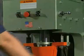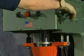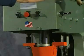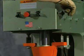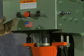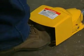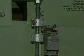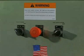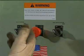The punch end three-position joystick allows for both up and down travel in the setup and run modes, and returns to the neutral or center position to stop machine movement. In run mode, the positions are fast down and fast up. In setup mode, the positions are setup down and setup up — use the setup mode for all tooling setup. The remote foot control can be used in lieu of the joystick and requires use of the limit switch button assemblies and the foot control on/off switch. Use of the limit switches greatly reduces the machine's stroke time, increasing productivity and allowing hands-free operation.